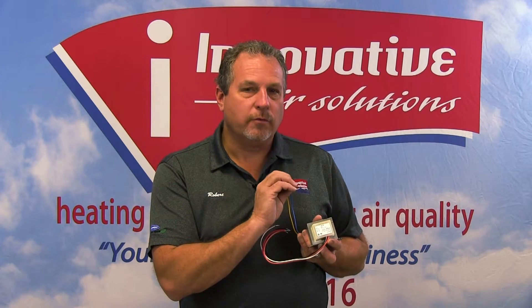In this particular case, the blue and yellow wires are a 24-volt power supply. This power supply will typically power our digital LEDs on our thermostats and will power the control voltage to our control boards on the inside and outside units. This power does not power the units on and off, but only the control voltage side.